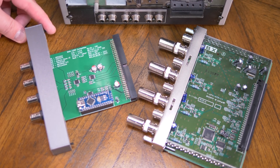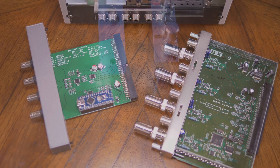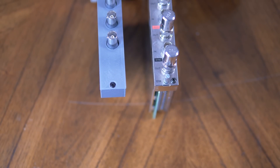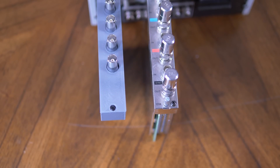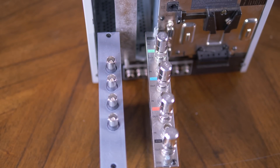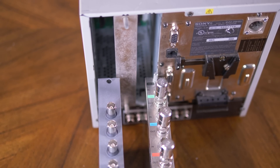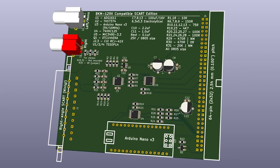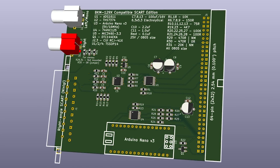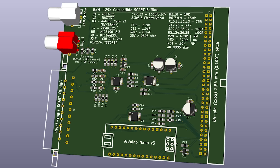The replacement card is a much simpler design and uses an Arduino Nano to emulate the software of the original. Its inputs are in the same order as the original, but it doesn't offer BNC outputs, which is good since you'll no longer be required to have 75 ohm terminators on the output, but bad if you were looking to daisy chain some monitors together. The developer is also planning on adding a direct SCART input design, as well as one with both BNC input and output connectors.